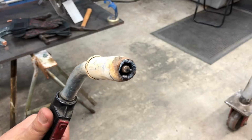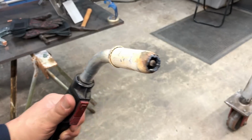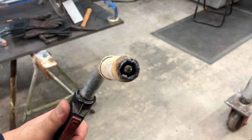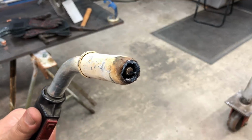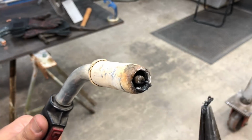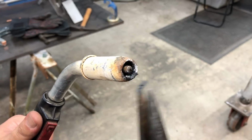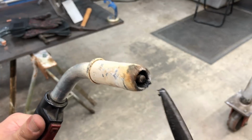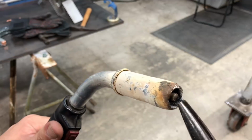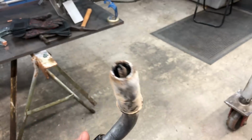So this is welded, 5 out of the 6 legs, and I showed you when we started I put the ceramic coat on there. What this allows is, you've got the buildup there around the inside of the cup, and it just pops right off, very easy. So it keeps it from sticking real hard and allows it to come right on off.